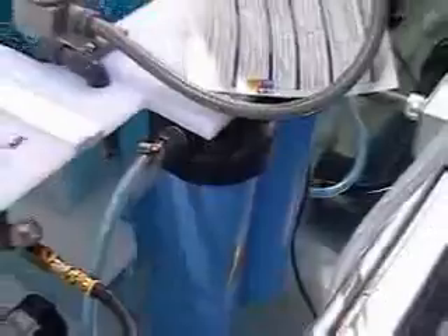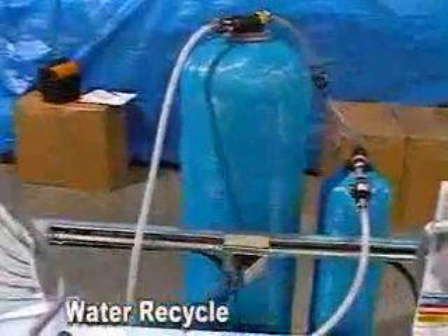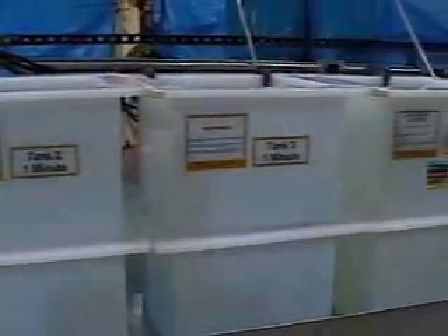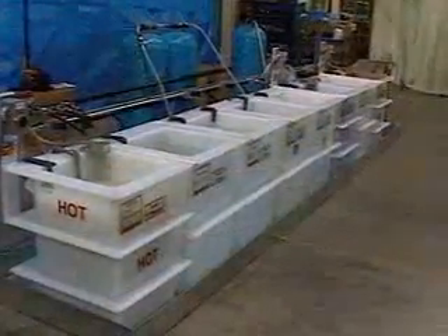The solution is simply pumped through two 20-inch polypropylene filter cartridges and returned to the tank. After blacking, the parts are rinsed again for one minute in another rinse water, which is optionally filtered through an economical two-stage charcoal deionization filter unit. Finally, the components are submerged in a water-soluble dewatering oil corrosion inhibitor and allowed to air dry. This is a typical Blackfast production blacking system.